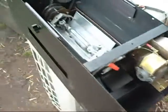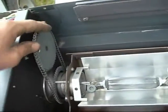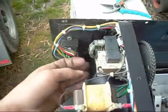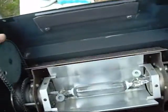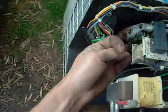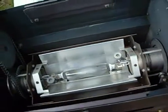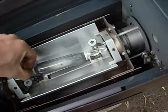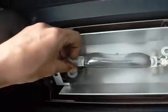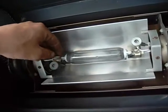This is the heart of the beast - we've got two cooling blowers for this one big bulb. There's a geared-down shaded pole motor to operate the shutter. It does turn with the brakes disengaged. It's closed with a little brake mechanism that clicks in and out - push it and it exposes the lamp. The globe itself has a bit of a bulge in it - two bulges actually. I don't know how good it is; I've just wiped it down with acetone so it should be nice and clean.